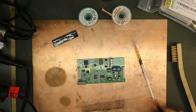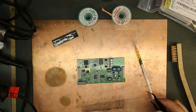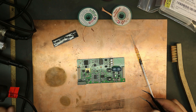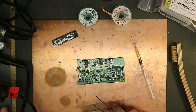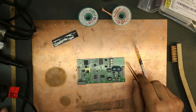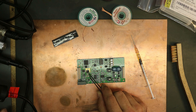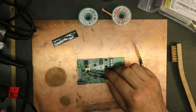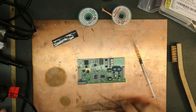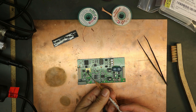I picked this board because it was recycler bound, and I also found a component on it that I thought would be a little bit more challenging. I selected that 1117 voltage regulator because it has a nice thermal mass underneath it to dissipate heat, so I felt like it would be a little bit more of a challenge. Normally I could have used a soldering iron on this, but I was looking for something a little bit more challenging than a resistor or capacitor, and you can also see it a little bit easier.